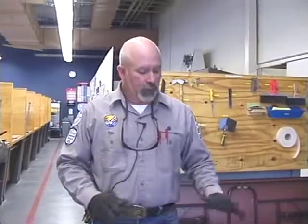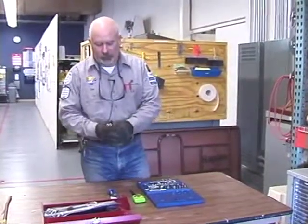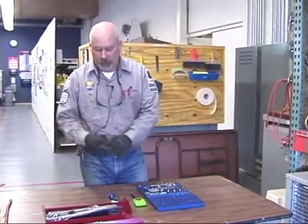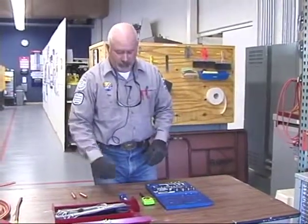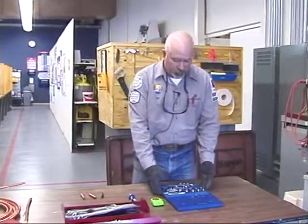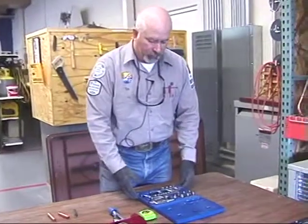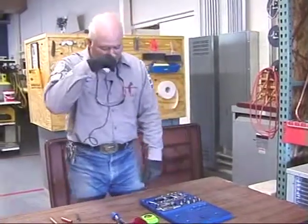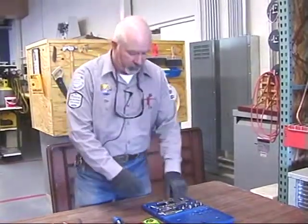Out in the field there are other ways of doing this. You have your two pieces of copper tubing that have been cut to about three to four inches in length. Don't forget your reamer. Our swaging and flaring tool is where it's going to come into play — it is designed just for that. You already know how to put it together for flaring, and swaging isn't much different.